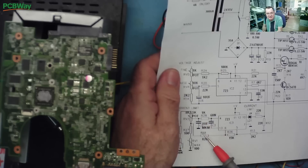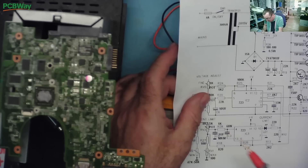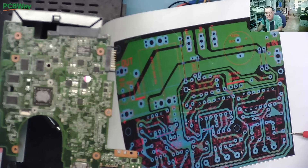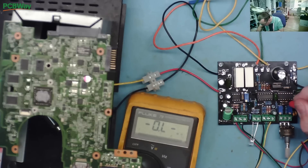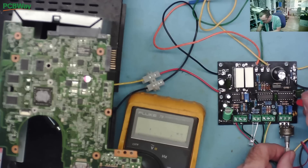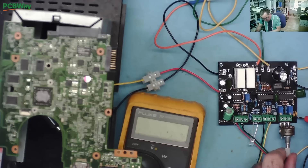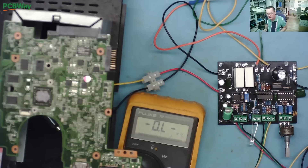The 1k pot is there, so it must be this capacitor or a bridged track. This is the 1 microfarad capacitor. Let's check — the 1k resistor is there and the 1 microfarad capacitor is here. Checking continuity — this end reads about 1k to ground, but the other end must be shorted to ground. It is — these 0.47 microfarad capacitors in parallel are shorted. Let's change them.